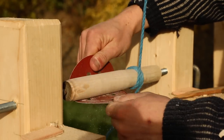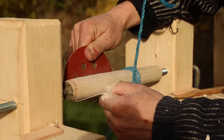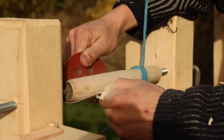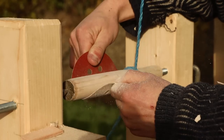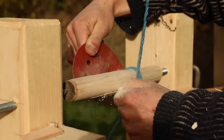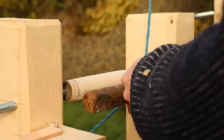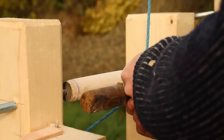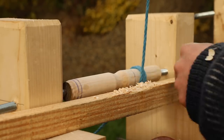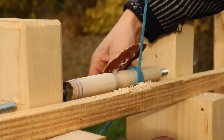Something I'd been meaning to try as well was using sandpaper on this thing. Normally when you're working with green wood on these things, I don't think you can use sandpaper — it'd just be too wet. Whereas this has had two years to dry, so it was bone dry and the sandpaper worked very effectively on it. After I had done a bit of sanding, it was time to do a bit of detailing. There's kind of a groove there that fits your thumb when you're using the chisel, so we're just cutting that out with the gouge.